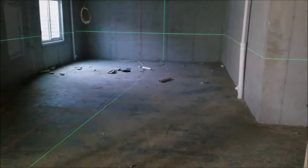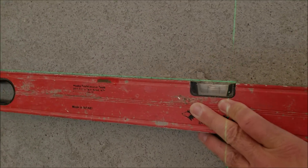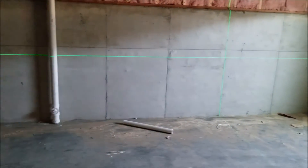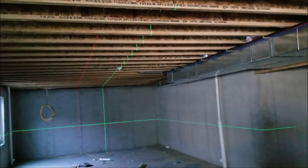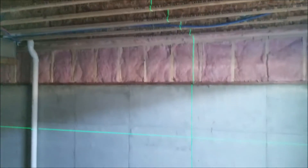Testing at about 30 feet away, both red and green lasers are visible, but the green is again a bit brighter. I grabbed my four-foot level to confirm the green horizontal laser line is level — everything looks good. Here's a look at the 360-degree projection of the green laser in about a 50-foot-wide basement; this laser is visible in all areas, including projecting on the floor and ceiling.